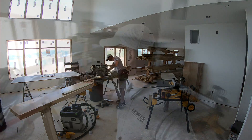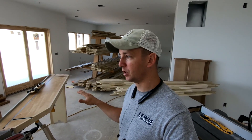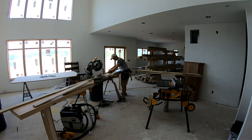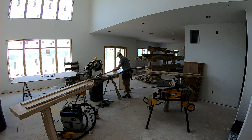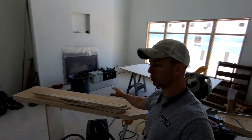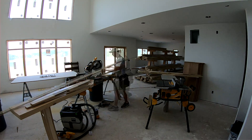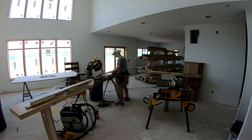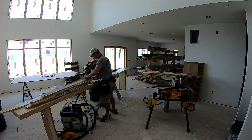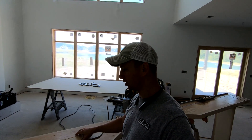We just worked through most of the cut list for the second floor. A couple things to note: number one, always start with your longest pieces first to optimize your material waste. You don't want to start with short pieces and end up needing a 100-inch piece with a bunch of scrap left over. Start with the longest pieces and then you'll have cutoffs for your short pieces with very little waste. If you watch that time lapse carefully, you'll notice this saw never had to be moved one time — it stayed in the same position, no swinging back and forth. That's the beautiful thing about this particular flat trim profile.